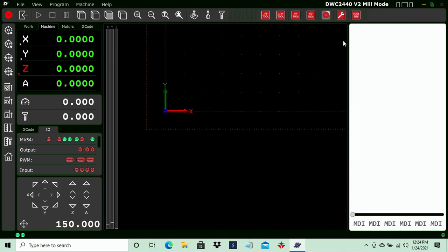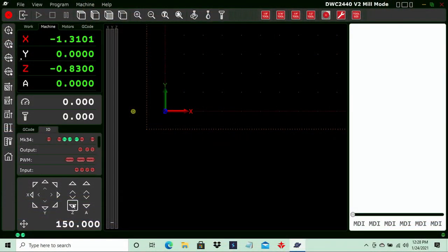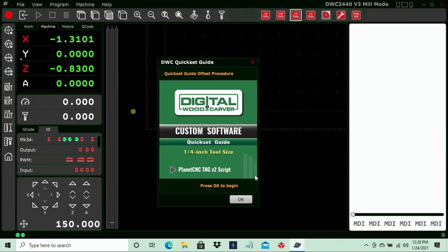When we put our quarter inch V bit in, we will use our quarter inch tool button. We'll also show how to use the circle center finder. So let's go ahead and change bits, get the 60 degree quarter inch V bit in the router, and run these two operations. Once we have the bit in the starting position of the zeroing function, we can go ahead and run the operation in the software using the quarter inch tool button.